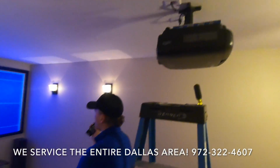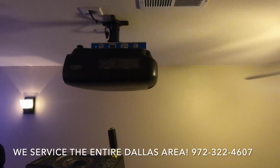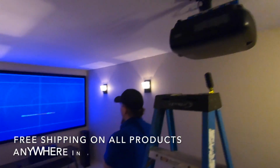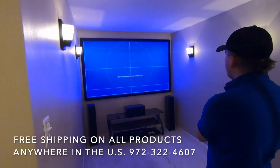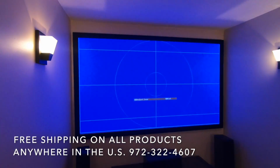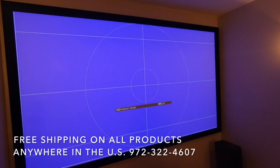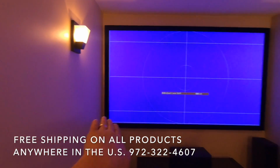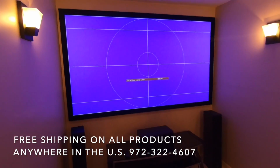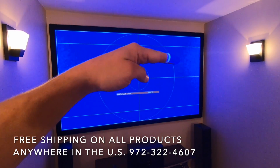You can see Grayson's already checked to make sure that the projector is level. That is key to you not getting a keystone. Level with earth like this. If the projector is not level, you're going to end up with a keystone. So now all he's doing is lining up the top lines right up here to make it level all the way across the top. And then you may have to move the projector to the left or right to get the bottom square. In this situation, we'll have to see how square it is here in a minute after he gets that right side brought up just a little bit.